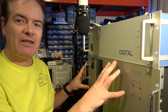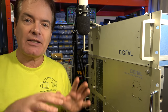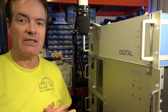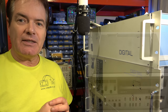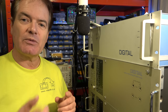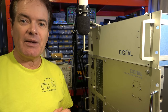The PCM-1630 was the decoder to have. There were special video decks designed for use with this. You could use an ordinary NTSC American TV system U-Matic video recorder, but it wouldn't be optimal. They made a DMR-2000, which was very well suited to this and would typically be used with a PCM-1610. And then for the 1630, where you needed extra heads and extra channels, they had the DMR-4000.